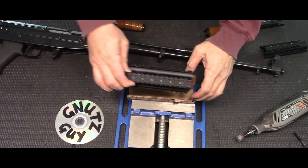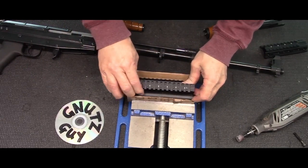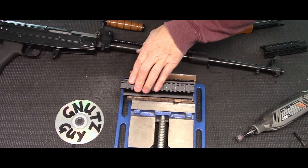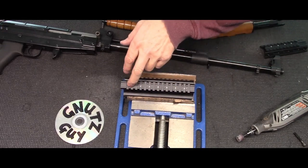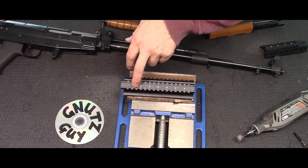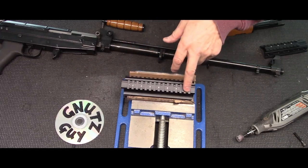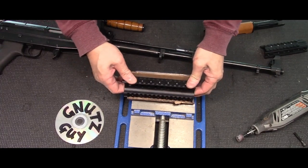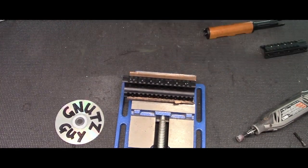So the next thing I'm going to do is to drill a 6 millimeter — or a 15/64 imperial drill. I'm going to use the imperial 15/64 drill. And the front, I'm going to use a 3/16 drill. Let me put this down.